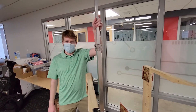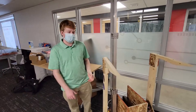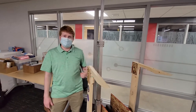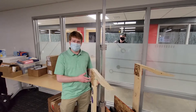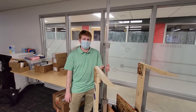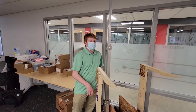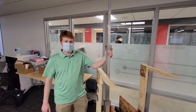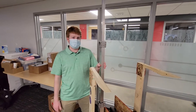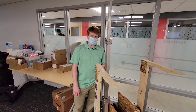We have the two-stage climber as shown here. This climber itself is very flexible and very easy to adapt to different situations. If you didn't want to use this top stage, you can actually just adapt it to be a one-stage climber instead. This allows for many different games and different potentials for use, allowing you to use it in different situations and on different robots independent of this year's game. One of the things we also found very beneficial with this climber is its adaptability — using pretty standard parts and pieces, it would be very easy to extend this to make the climber longer or combine it into different configurations tailored for the robot you're building.